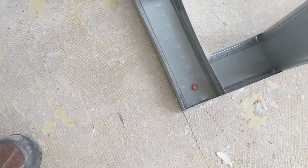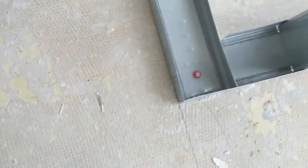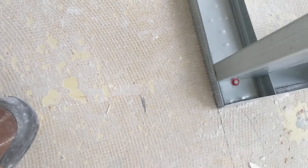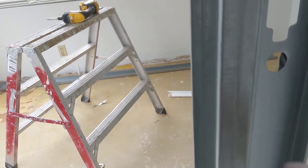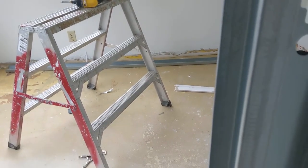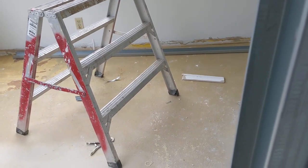The stud corner is done this way. One track goes in, cut it back, nail the other one on, the stud will go here right down the corner. The drywall will go right in here and then we screw it all together. The stud just stays loose like that — that is for the drywall just to run behind.